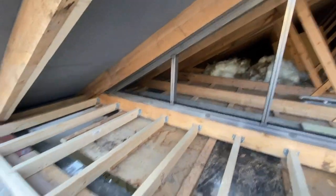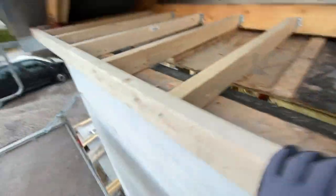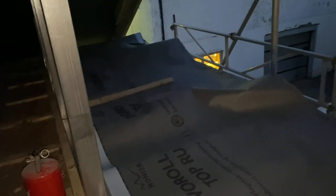Since the frame is totally finished, I'm continuing here on the terrace. I put up this gips plate underneath there, and I'm going to do the same all the way down. Gips is now on. Now I'm going to put insulation from here to there — it's much easier to do it now from the top than from down under later on. The insulation should have plenty of room here.